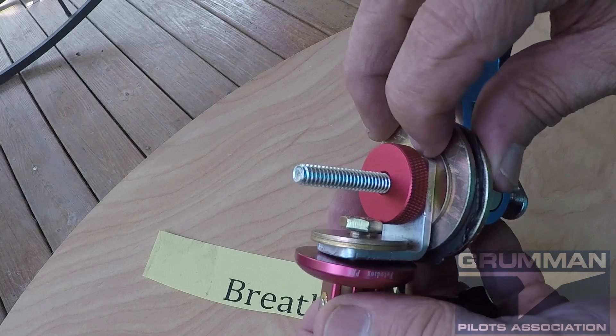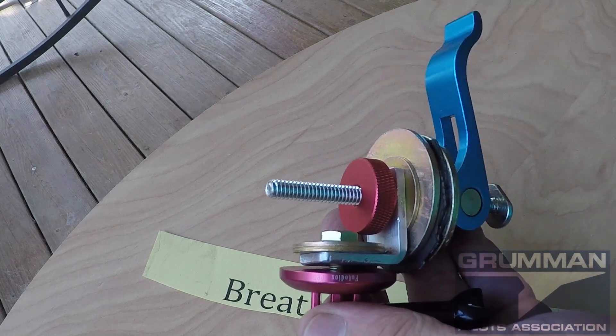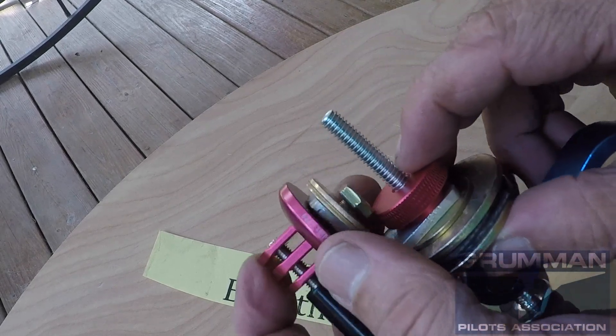This is angle iron, three-quarters of an inch wide. I want to add a note on this aluminum piece: I did cut it off bar stock with a hacksaw and then with my little pneumatic reciprocating saw — it was harder than I thought to do up on the workbench. Then Matt was nice enough to grind it on the grindstone. Matt — aka Shopmonkey, and he does prefer Shopmonkey over his real name — was nice enough to get these washers and assemble everything. The piece is three-sixteenths thick; this section is one inch, this is one and a quarter, and we allowed the one-and-a-quarter for the bend to flow over. You just mark it, bend it on a vise with a hammer, then sand it smooth.